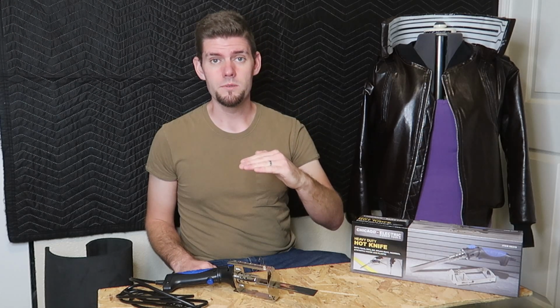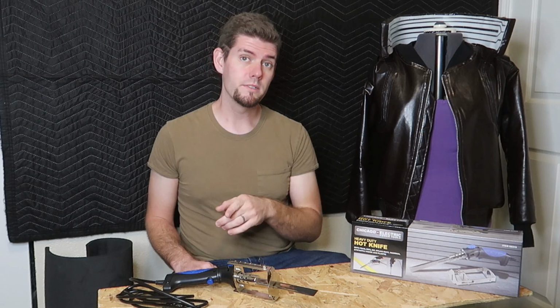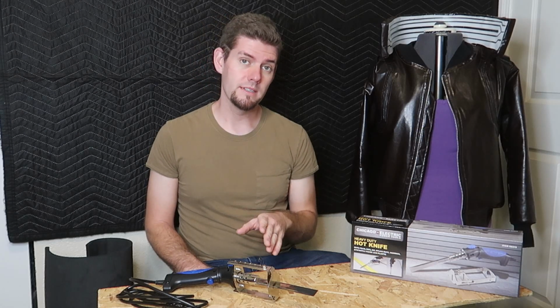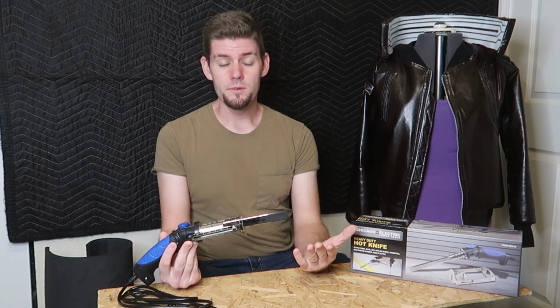Its peak use does say 130 volts, and that just kind of gives it that flex capability. So when you initially turn it on, it'll kind of spike and heat up quickly and have a little bit closer to 130, and then it drops down and levels at 120. So the tool itself will actually peak a little bit. If you have a lot of lighting and everything all in one circuit, when you pull the trigger, you will notice your lights dim. That happened to me a couple of times, but my breakers I made sure are very strong, and I don't have any weak 10 amp breakers in my house anywhere. They're all 15 and above, which is nice. So everything in my house is rated to be able to run a proper 120 circuit without any issues. The most I'll get is a light will dim on me a little bit because of this tool being in use.